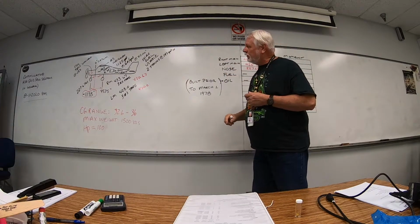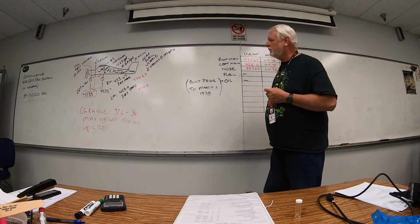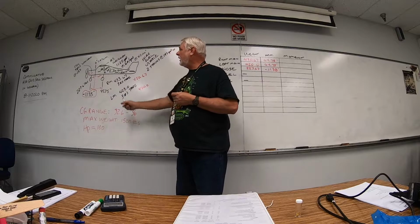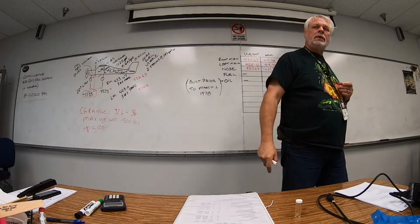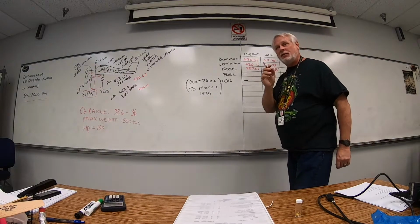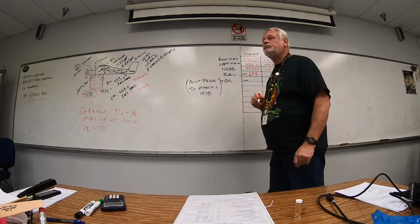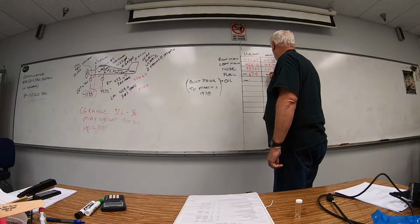So you take the fuel out. We had 11.25 gallons. Somebody with a calculator help me along as I go, if you would, I'd appreciate that. So as weighed, 11.25 gallons was our usable, drainable fuel. At 6 pounds per gallon will give us a negative because we're taking the fuel out, 67.5 pounds at station 42.